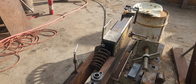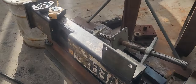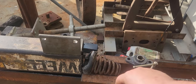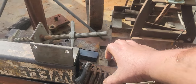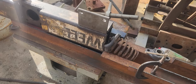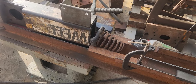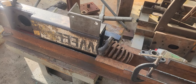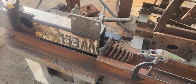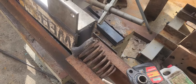I did a major redesign - major, major redesign. Almost a year ago, this tube used to be longer and I had slots cut into it in an X formation. The idea was that I was going to have a yoke move back and forth to adjust the tracks. That was fine and dandy, but the tube itself has a lot of stress in it, so when I machined those four slots it splayed out, warped, and it was a problem.